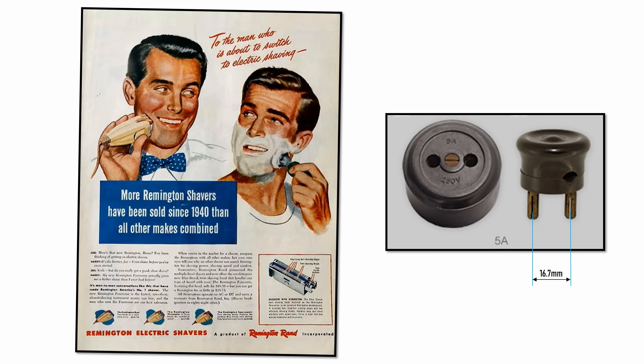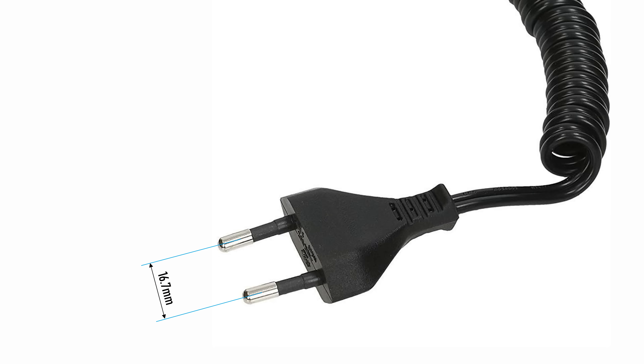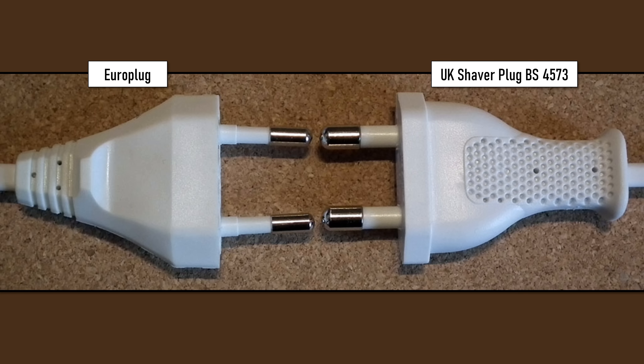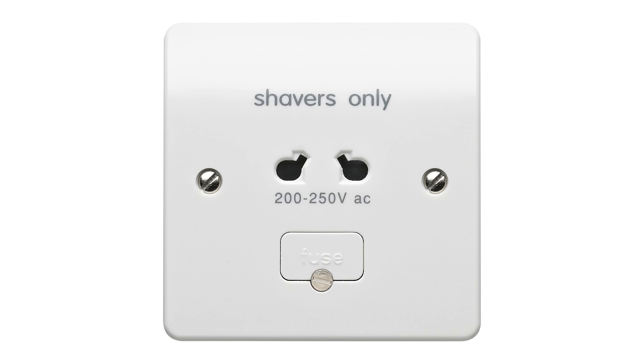Many of those 1940s electric shavers used the old BS372 5-amp plug, the one defined back in 1930. So the new standard kept the same size and spacing of the pins, meaning as long as your existing shaver didn't draw too much current, it should work perfectly well. What's more, this plug is surprisingly close to the 2-pin Euro plug shape and size. This hasn't been lost on those designing shaver sockets, so they've designed their sockets so they can also accept Euro plugs, and more modern designs also allow 2-pin US or Australasian plugs to be inserted.